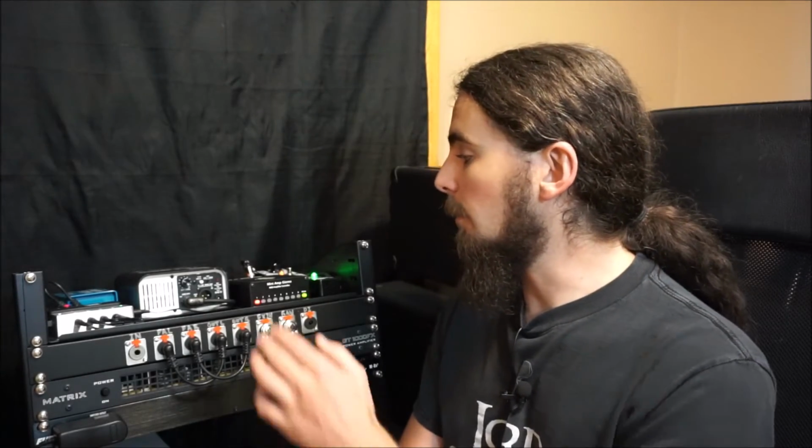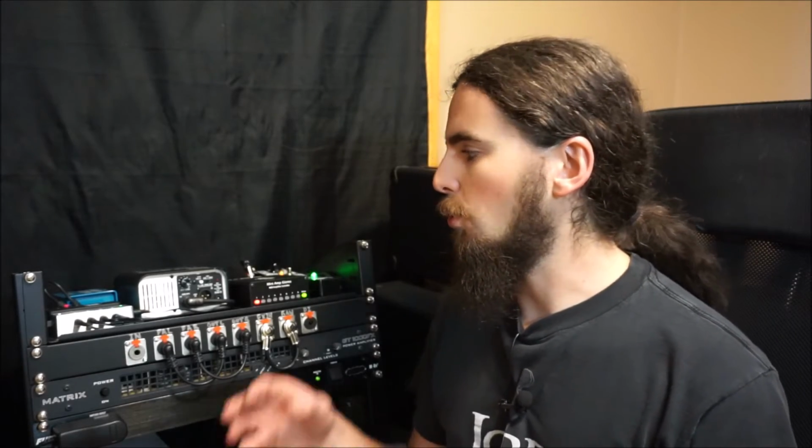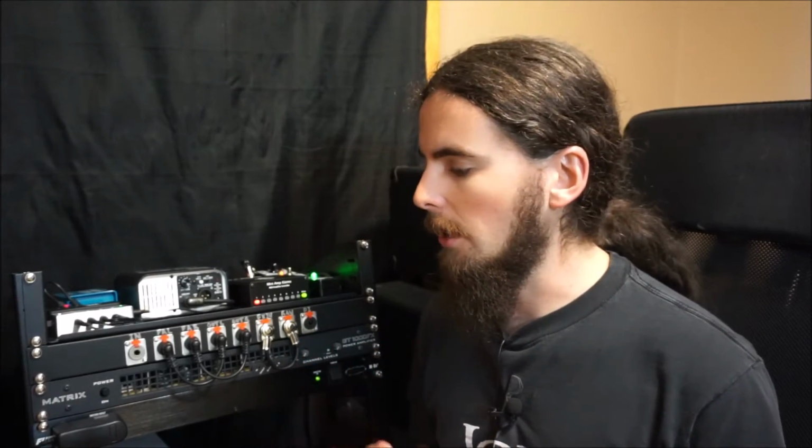And the cool thing with using a load box in conjunction with a power amp is, you can still get that moving speakers, moving air type of vibe, but at lower volumes that aren't going to completely rattle the room so bad if you are living in a situation that's a concern. And you can crank both the master volume and the channel volume on your amplifiers and get that saturated sound at a lower volume. Once again, without compressing the cabinet so bad if you're not going for that really high-strung, high-volume speaker sound.